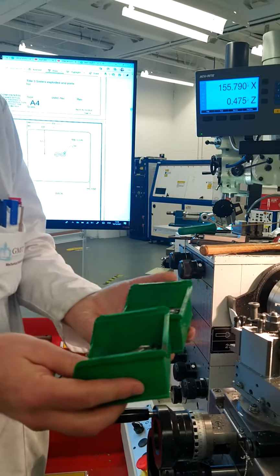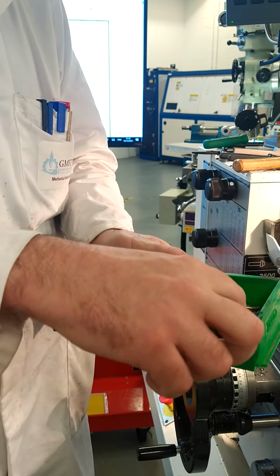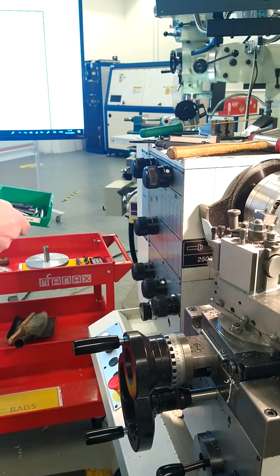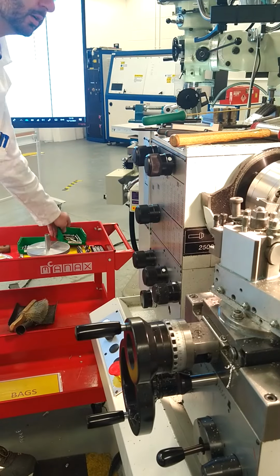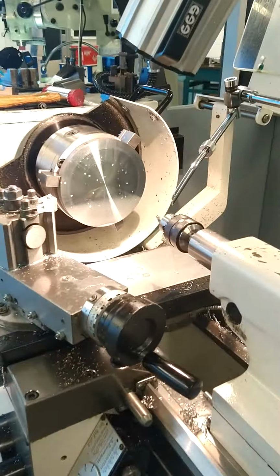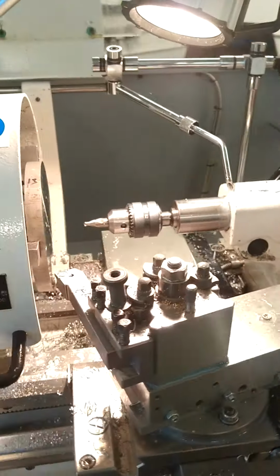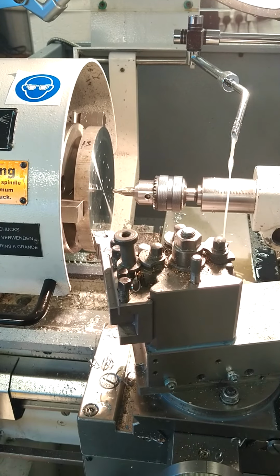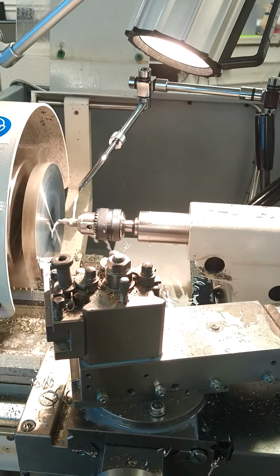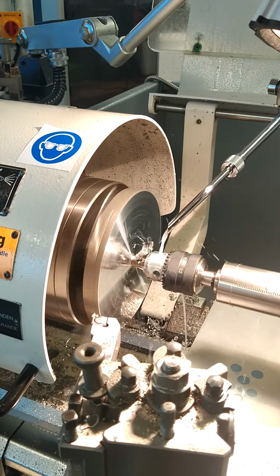The first thing we're going to do is drill with a center drill bit, to make a pilot hole. They come in different sizes, and we're going for one of the largest ones here that will fit into the chuck of our drill. So we're going up to a number 6, number 7. Taking your chuck, center drill the hole, with the correct size placed in the chuck, and now we're going to prepare for center drilling. The speed set for the center drilling is 540 RPM. We're pushing forward into position, and remember from previous videos, you apply the lock on this tailstock, power on our lathe, and you're drilling forward, applying coolant down to the drill bit. As we're going to drill a 19.5, we're going to go right in with that center drill to create a good sized pilot hole.